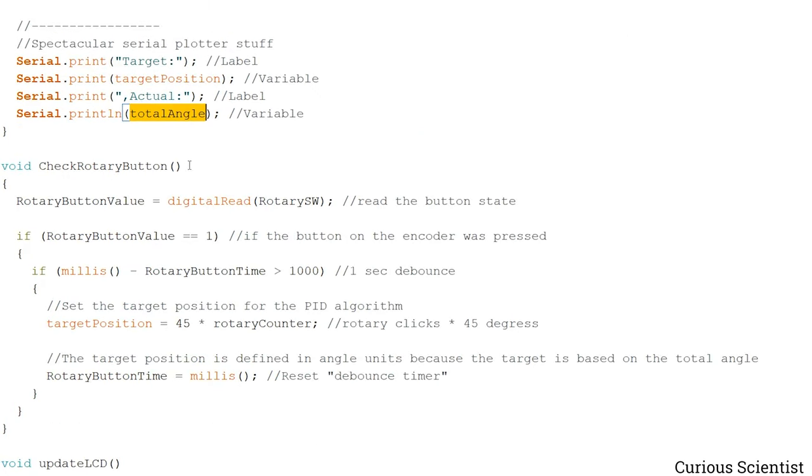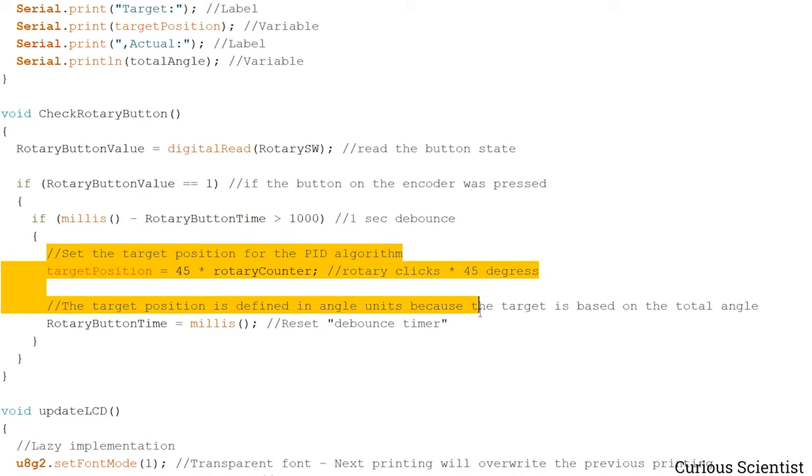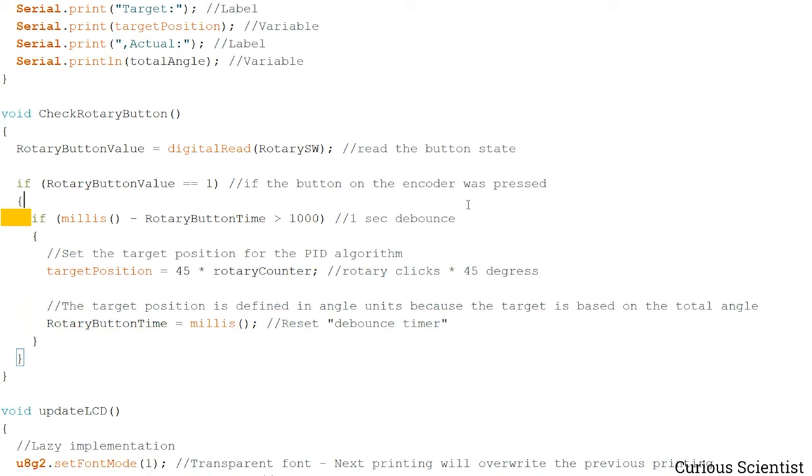So the first function here is to check the rotary button. This is the same as I've been using for years. First I use digital read on the button of the rotary encoder, and if the button value is 1, and if the elapsed time since the last press is more than 1 second, then I enter the function. If the pulse from the button press comes within less than a second, then that is considered bouncing. So with this simple line, we kind of debounce the button,